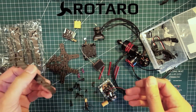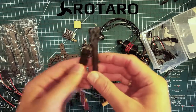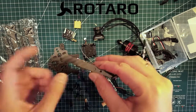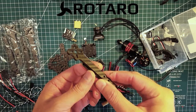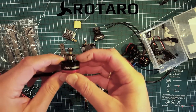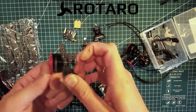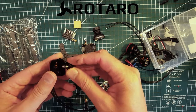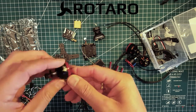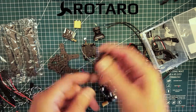On this build I'm going to try to have the ESCs — which are the 30 amp Racerstar — on the bottom of the arms this time, just to avoid prop strikes. The motors are the new RCX RS2206 2400 kV motors. They are really nice — steel shaft and strong magnets. It's going to be exciting to see how these motors stand up to the others, and they are like nine dollars.